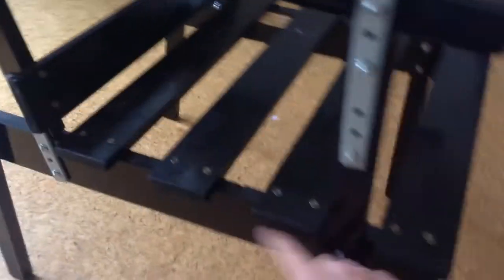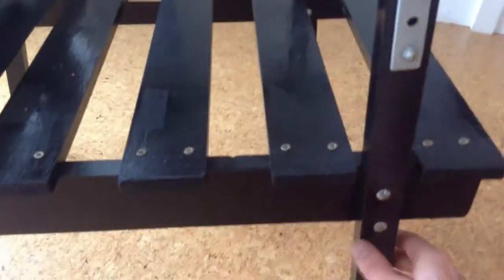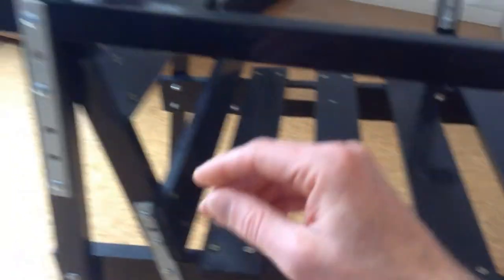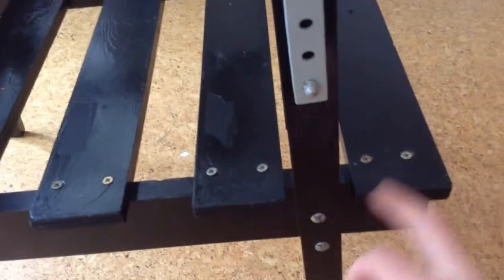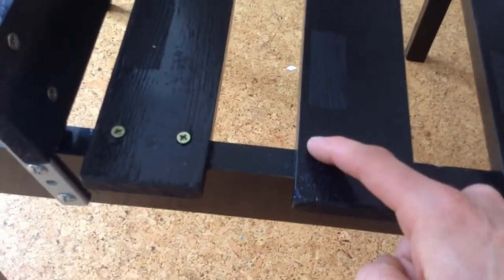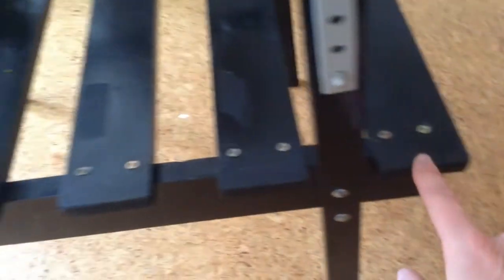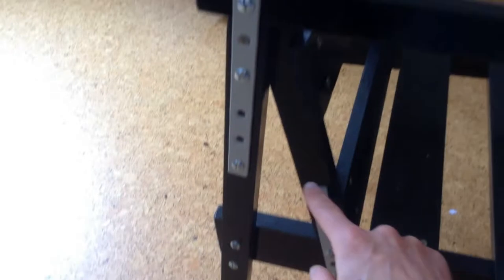And you'll see that all of these slats, this is the primary structure, the leg and the strong bit, and the legs and the back and the arm, that's the primary structure. And the slats, you'll notice that they sail past to not clash. That's because I wanted these screws to be away from the end grain. If these screws are too near the end grain, it will lose strength. And so it's no accident that these slats oversail past the primary structure.